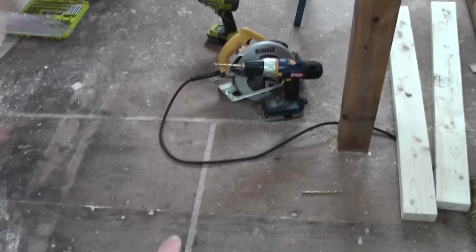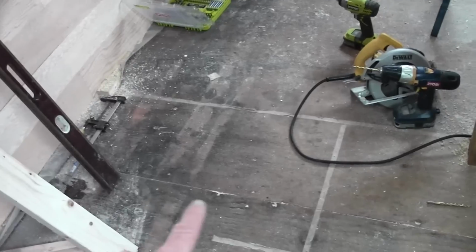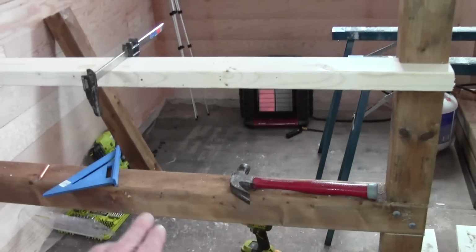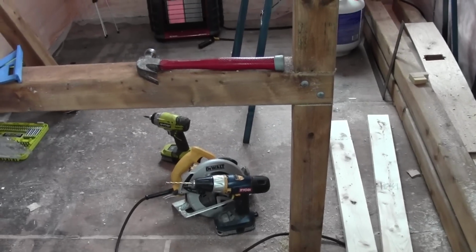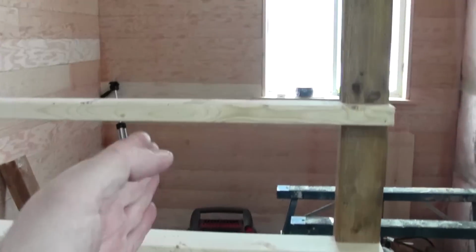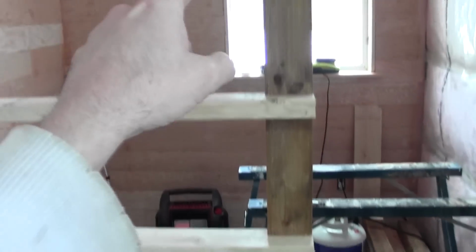So this tape here is where, when the bed is slid in, it's actually going to stay stuck out that much, and that'll be a couch there. The top of the bed will slide in underneath here and go all the way back in. So with this extra space here, I think now what I'm going to do is use a 2x6 or 2x8 and notch each of these out of it. I still need one more there. And then the 2x8 will actually fit on over top of it this way, and that'll support these sides. And then this could actually be the ladder up.